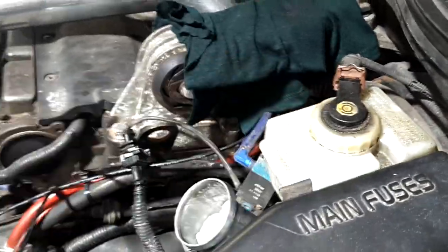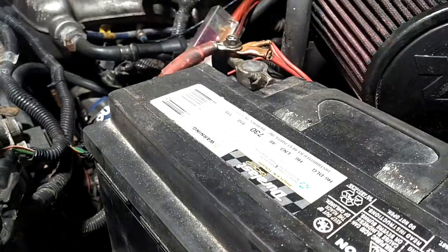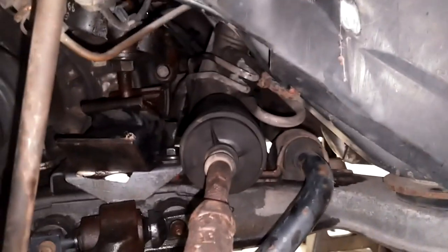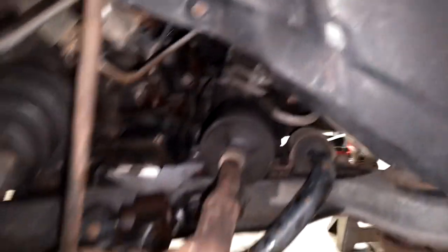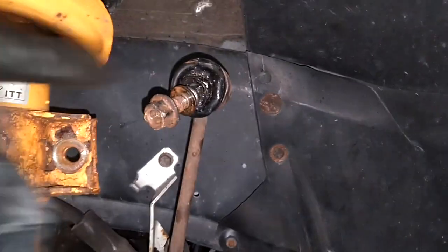We're going to put this intake on and start the car, see if we can get it to go through the gears. Another difficult point was getting the steering rack to fall into place — with the subframe lowered that wasn't working out. We struggled with that for about 15 to 30 minutes, then Dan reminded me that the subframe was lowered. So we raised the subframe up and the steering rack started falling into place without breaking anything loose. Now I've got to torque this bolt, hook up the sway bar end links that are destroyed and need to be replaced, then fire this thing up.